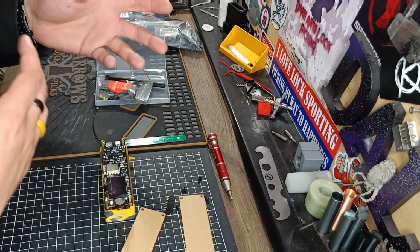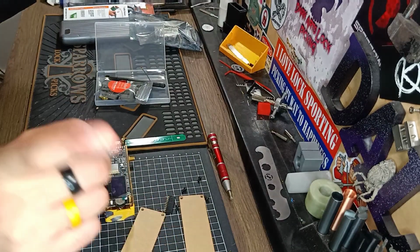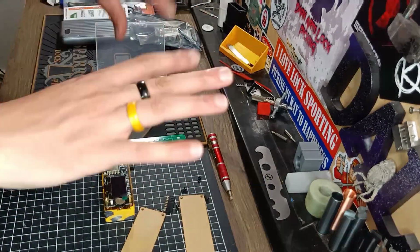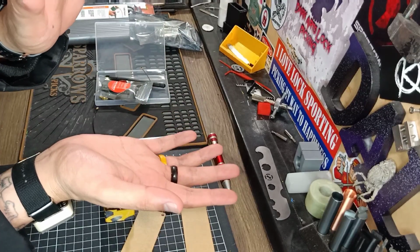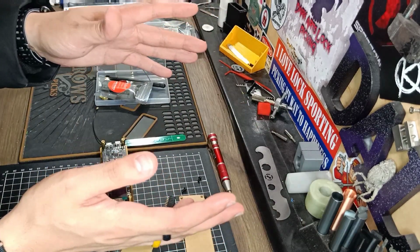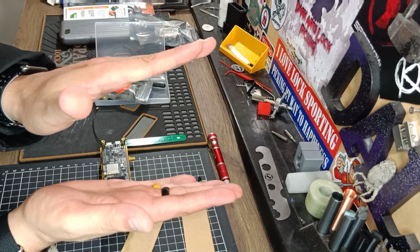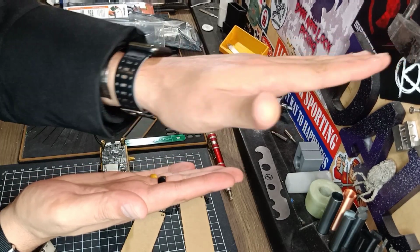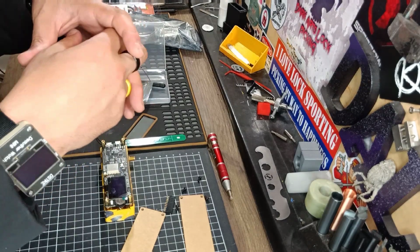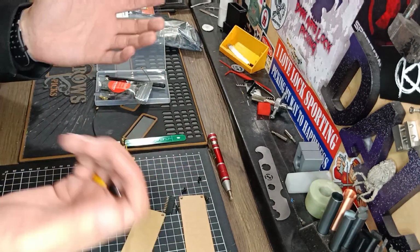So like with CBs or UHF radios, the higher the dB, the greater the distance it covers. But in rocky areas, if you have a 3 dB and you're in a very mountainy area, a 3 dB puts out a signal, for example, say, this fat. Which is great for very rocky areas and stuff like that. Whereas the higher the dB, instead of having big fat waves that go out, it kind of gets smaller and smaller. So it actually pushes them out faster and further, but the waves get smaller and smaller. So with an 18 dB aerial, I'll have a greater range, but it may miss some of the stations up close. Theoretically, well, that's what all the diagrams and everything says.